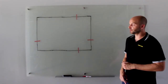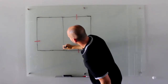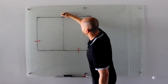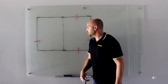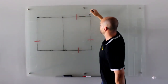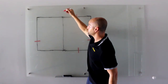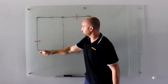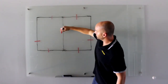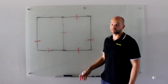Let's assume that on this project we've got an intersecting T-wall running through the middle of it. Now, if we used a form T-block provided by the ICF manufacturer and put that T-block here and here — T-blocks are essentially another corner. So when we're building with the T-block, we go from corner to T-block and create another marriage line, corner to corner and another marriage line, and another corner-to-corner marriage line. Basically, we went from having four marriage lines on this project to now having seven.